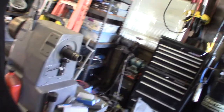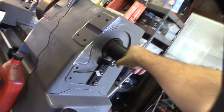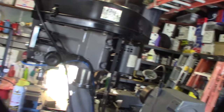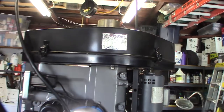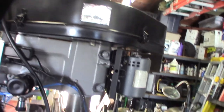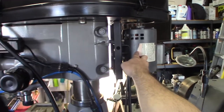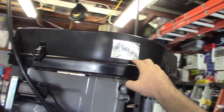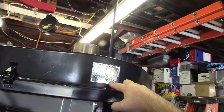The cool thing is on my lathe I actually have a tach I built onto it, so I can use that as a reference to see how accurate this thing is. On the mill there's a belt pulley chart, so I should be in the right range. The motor I think is around 1700 RPM, so the max setting should be around 2500 RPM.